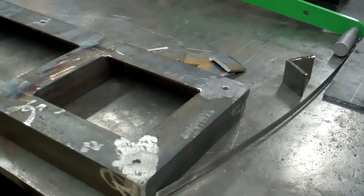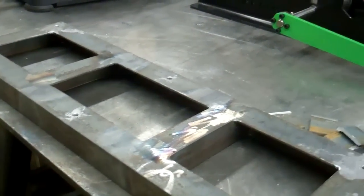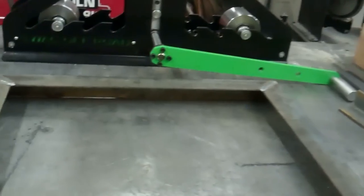I had to grind it out in here where the bolts go on the corners. The next step will be to make the bottom piece. Yeah, this angle iron must have come from some other country. It's about 25 thousandths smaller than 1/4 inch, and look at it, it's all bent. Yeah, so now what I'm going to do is make the bottom piece of the stand. Yeah, I don't have the wheels yet. Yeah, I got the bottom part all welded together.